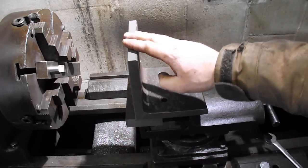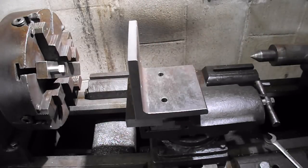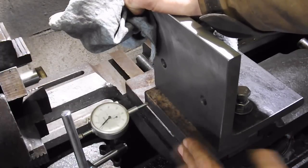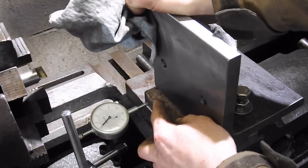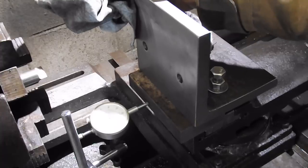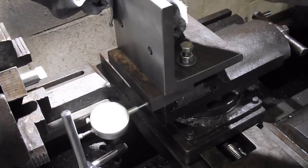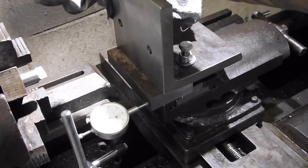The nice thing about using this angle plate when doing the fly cutting is it makes a great shield. That's kind of a big reason I use it, other than it's already got the holes the correct distance for my T-nut down here. Got the piece clamped down. I'm at 2 on the indicator at this end of the piece of metal. Going across, it drops down to 0 out here in the middle. And then when we get back to the other end out here, it comes back up to 2. Well, there's 1.5. Since it's just a mill scale finish, that's close enough for me.